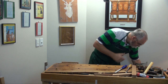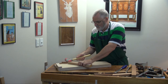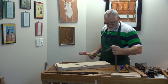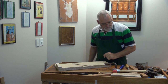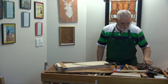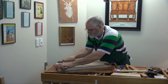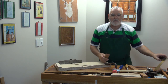Getting a bit of a mess here, but anyway. Put that up there, the dog's up there. I don't want the 45 in — get rid of that for the moment. And I think we'll have a hold-down so it doesn't wobble about too much. That's not going anywhere. There's the one that's nearly 90 degrees. Pop it up against there, grab our plane. There you are — that's at 90 degrees.